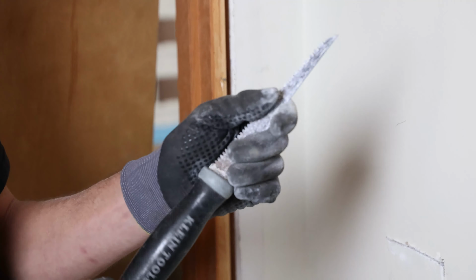All right, quick tip. Romex, this kind of stuff, needs to be secured within every 4.5 feet. That's the max distance it can span without being secured, but there are a couple exceptions. Exception number one, or interpretation rather, is every place it passes through a bored hole like this, by the code, that's counted as being secured and supported. Second is where it's fished in voids and cavities, like we're about to fish it down the wall to that 2-gang switch box. It is not required to be supported or secured. So where it goes through the bored hole at the top of the wall, supported and secured. Where it fishes down the wall, not so much.